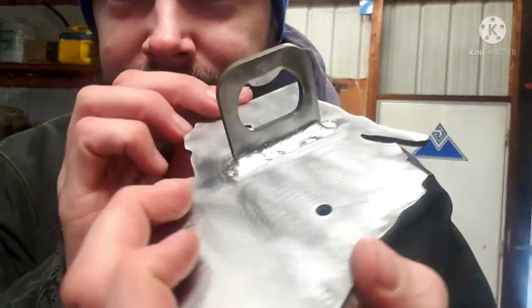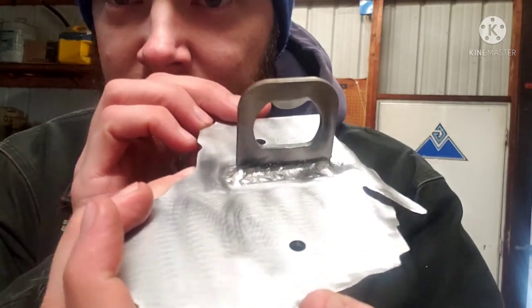So I kept getting that error message, and I thought there might be a problem with the welder. Luckily, the Miller 215 is multi-process: it'll do DC TIG, DC stick, and it's also a wire feed welder. It's a great machine. Up until yesterday, I was having that issue. So I switched it all over, went back to wire feed, went to MIG welding, and did a couple of welds in MIG just to make sure the machine was welding good. And yeah, I don't know if that error message was coming up because I kept sticking the tungsten, which, okay, that makes sense. That was probably it.